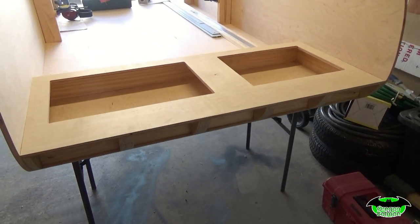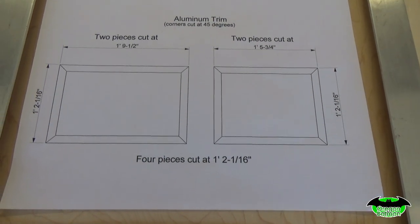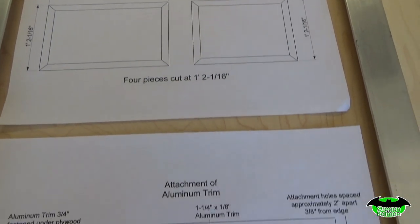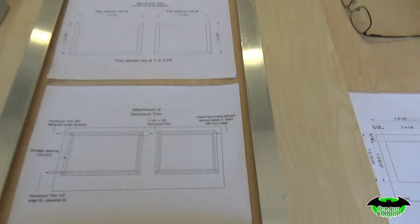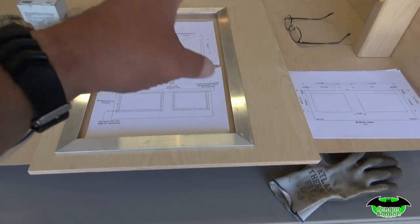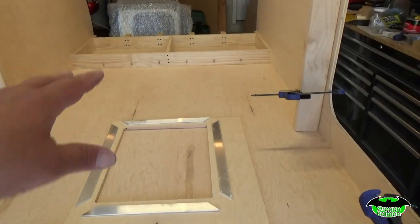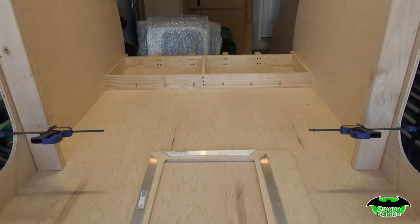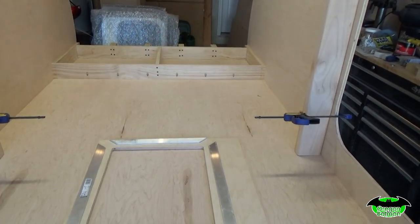Here's the layout of our metal trim that we're going to be putting under the rear floor — location, attachment points, all mocked up. We've got things setting in place, so now we're going to pre-drill our holes and go ahead and fasten these down on the underside, flip it over, put it on top, and get this compartment sealed with some varnish. Got all my aluminum pieces cut, mitered, and pre-drilled, and now I'm fastening them on — one fastened, looks pretty good, and now I'm ready to fasten the rest.